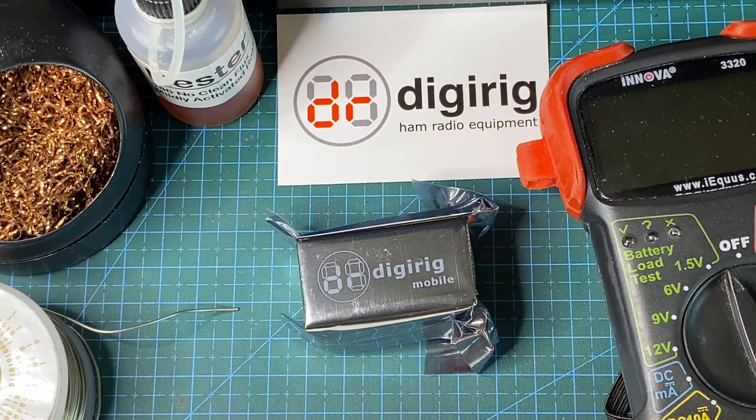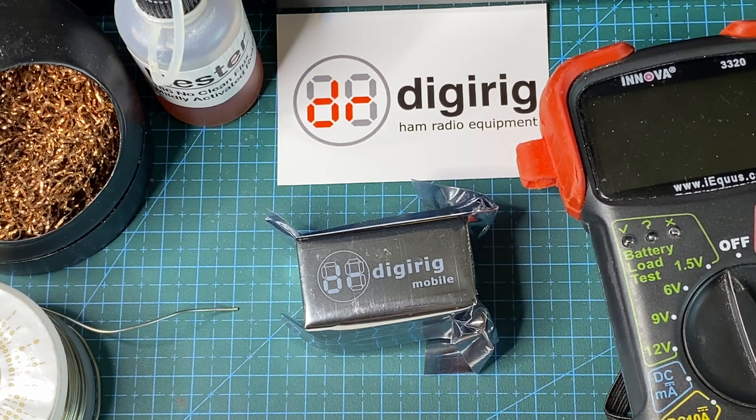Some radios use RS-232 levels, for example, Elecraft KX or many Yaesus and many Kenwoods use RS-232 ports. Those are traditional serial ports like used to be used for mice and modems. Electrically, that means that levels change between minus 12 to plus 12 volts, which is significantly different. And there is a CIV configuration used in ICOMs that uses a simplex single line with logic levels, 3.3 volt signals. And there's also a TX500, which is basically logic levels with additional power supply output.